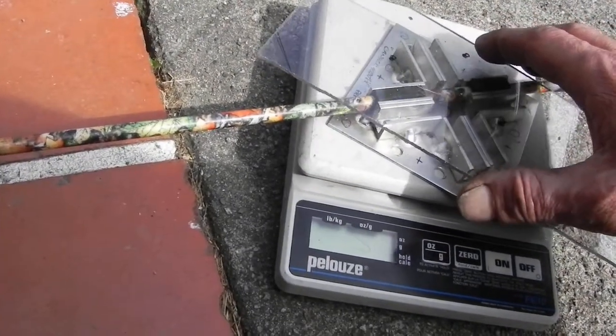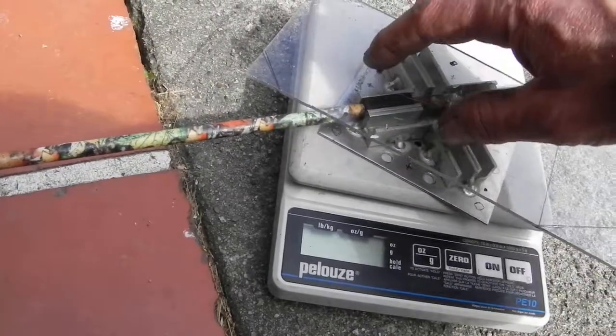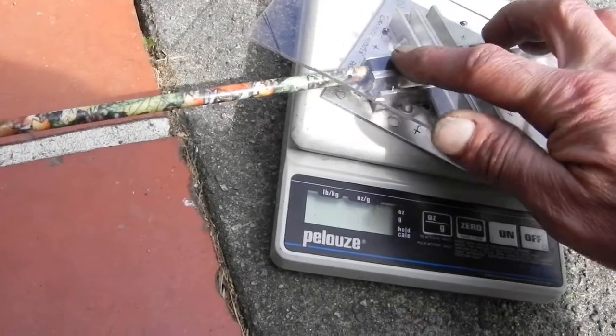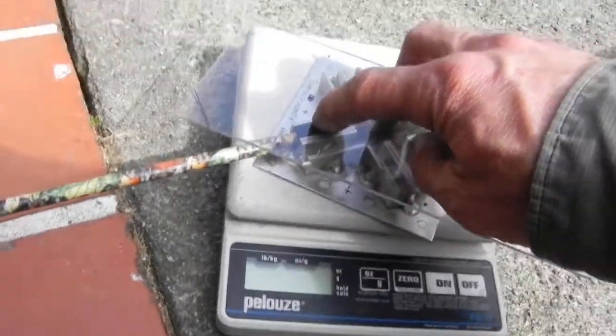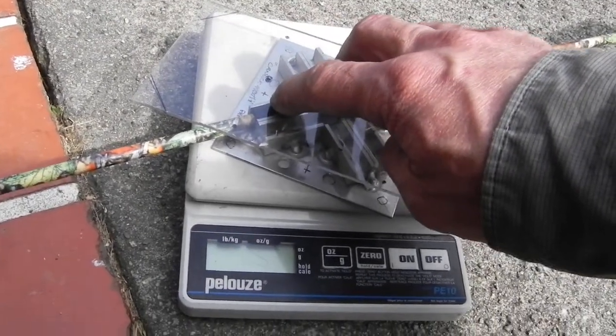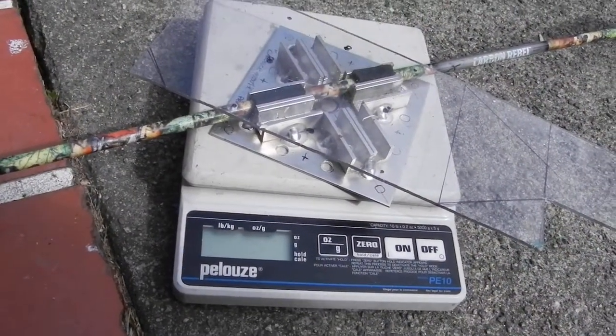like this, so that we have 2 bolts here, 2 bolts here. So we have a total of 4 bolts, and that will compress our Viton rubber onto the arrow shaft. And it's almost, I couldn't pull it out when I clamped it, so the rubber compression is about 1/32 to 1/16.